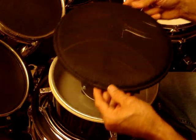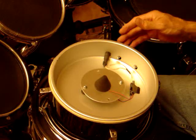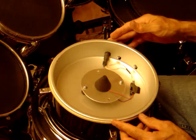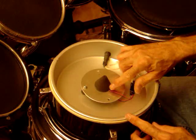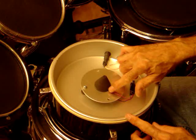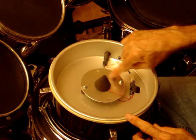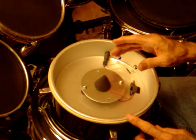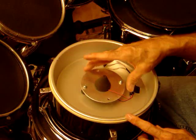Underneath the drum head we have the business part of the drum itself. The electronic drum has a trigger mounted underneath a cone — the piezo trigger is mounted underneath this cone to the surface. This surface is an electrical conduit cover plate; you can use any kind of flat metal, it doesn't have to be that, just something reasonably solid.